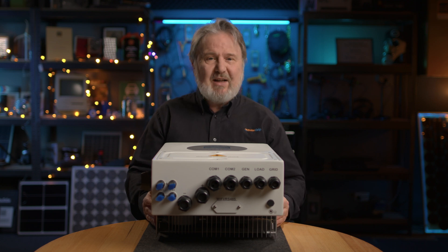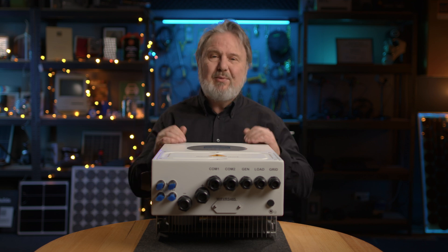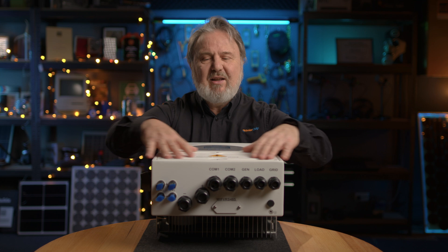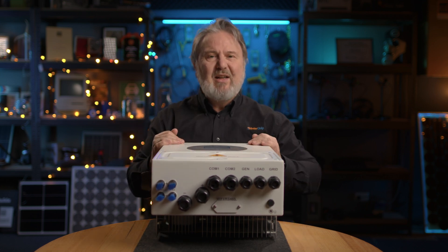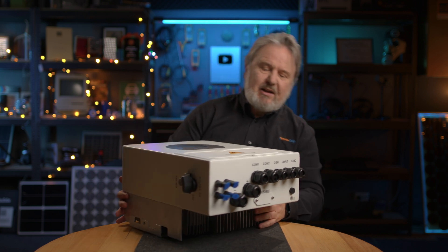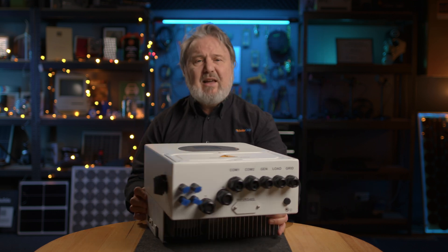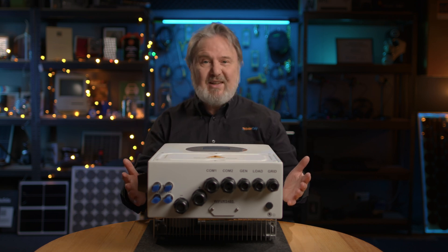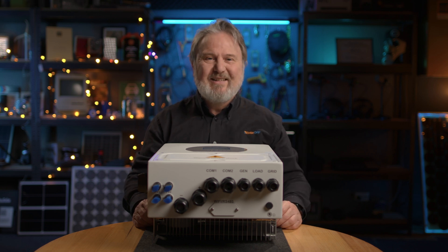It is AS4777 Part 2 compliant, so you can install this unit. It weighs 15.1 kilos, so it's actually a really sweet unit. The other thing I like about it is the wiring enclosure — you actually bring all your cables inside and terminate them in here, so not a lot of plugs. Of course, there are the standard plugs for your PV modules, but all of the AC and comms go internally and have a termination inside the enclosure. If you enjoyed this unboxing, check out the installation video coming soon. Thanks for watching.